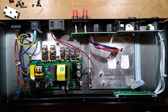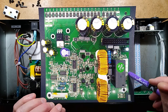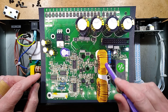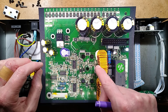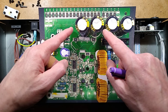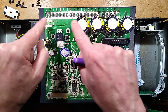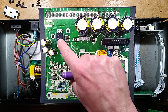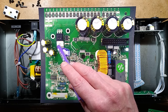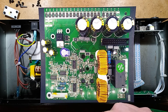Looking at the amplifier circuit board: there are the speaker output connections. That relay is the anti-thump relay — designed to only engage once the circuitry is stabilized. These inductors and capacitor networks are the output filters to remove high frequency switching noise. We've got local smoothing capacitors — two for the plus rail and two for the negative rail. There's a massive array effectively a programmable array of resistors tied into the chip, which may be for sensing or a local power supply, particularly given the Zener diodes — it seems to be detecting a threshold.